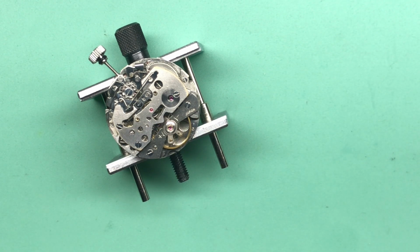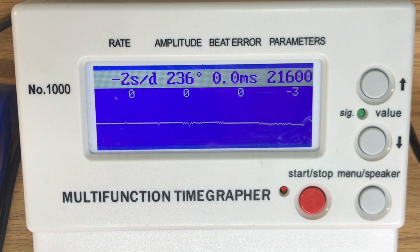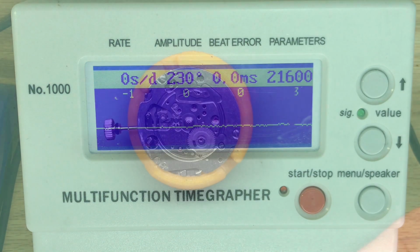Okay, there it is, back up and running. Okay, Steve, well, this was a very long battle that I had with your hairspring. Somebody had done some pretty serious tweaking to it, and it was way off. I couldn't adjust anything. The timing was just totally off. But we have gotten there. This is really a triumph, I think, for where we were, and I'm really happy, and I'm going to start putting the movement totally back together. All right, thanks.